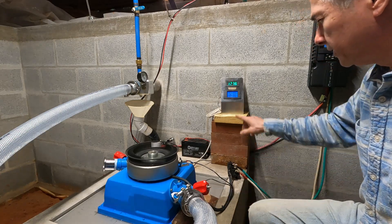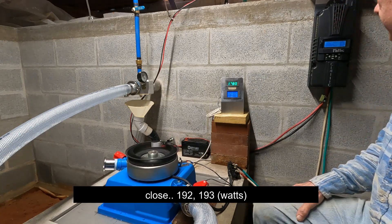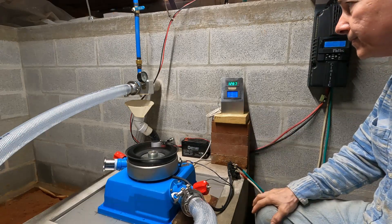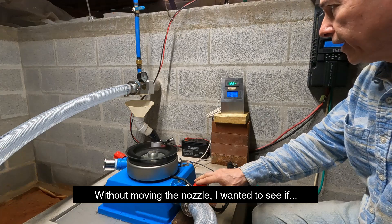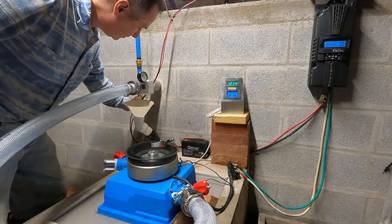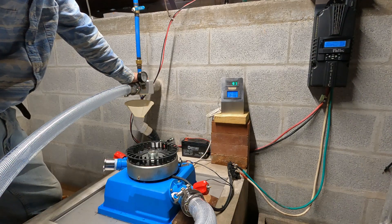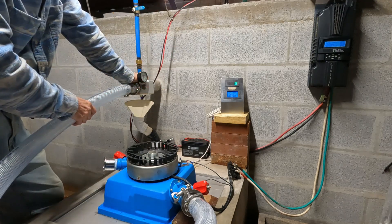The air worked its way out and it jumped right back up to close to 192–193 watts, still holding at 70. It has to switch over to 74 at some point. Trying to get more than 190 — right at 194. Without touching anything, I wanted to see if it jumped right back up without having the MPPT charger dance around for nothing. That way there's no need to search for the maximum power point if we already know what that setting is — it just goes straight to where we set it.